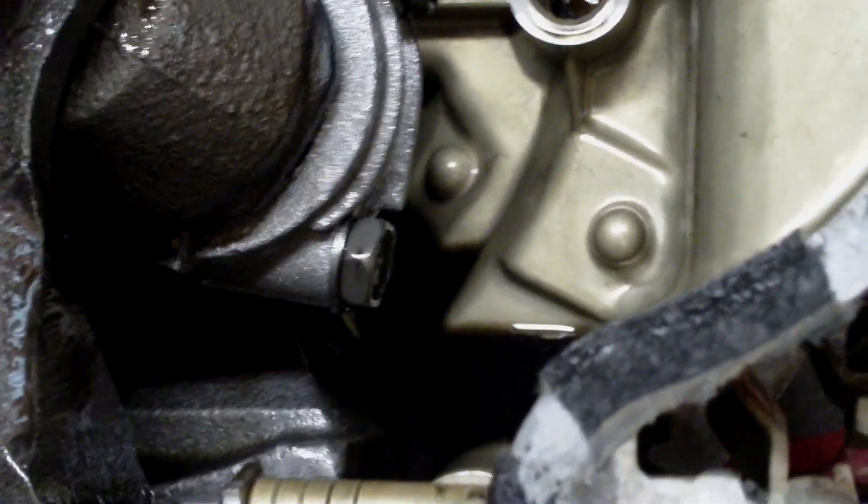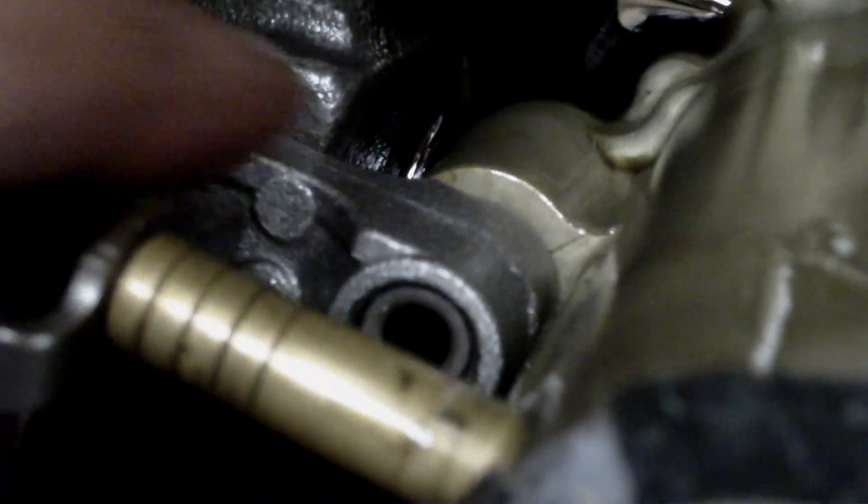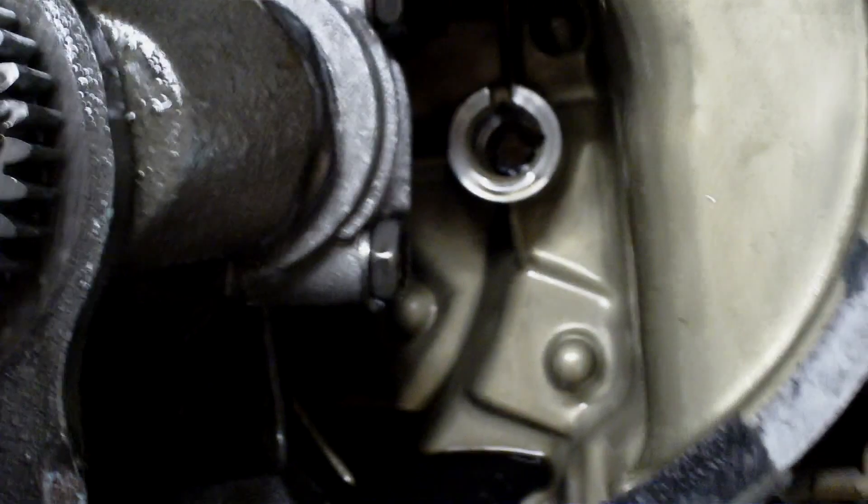Here's a view inside the block — this is your connecting rod. On some engines like this one you just loosen the bolts, but on some other types there's a metal plate with little tabs that bend over your bolts to lock them in. I like those better — these tend to work loose after a while. If I can find one I'm going to put one on here so you don't have to worry about the rod bolts coming loose and throwing the rod. These here are your counterweights. A lot of people call that little rod connecting to the counterweights the connecting rod because when the counterweights let go that rod breaks and they see it. But this is actually your connecting rod — it connects to the top of your piston and works off your crankshaft, connecting to the piston and the wrist pin. We're going to pull the piston out in a minute after I loosen these bolts.